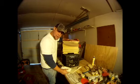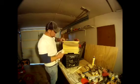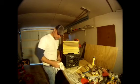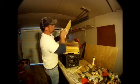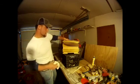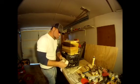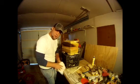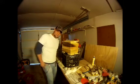I don't think I'm going to stain it. I think I'm just going to clear coat it because of the grain color that I have. Usually I clean these off, get all the dust off with mineral spirits. It evaporates the small dust and helps collect it on the cloth. So yeah, that'll be real pretty. So a little more cleaning, sand it with 1000 grit, and then be ready for a first coat of poly. And we'll get the towel on.